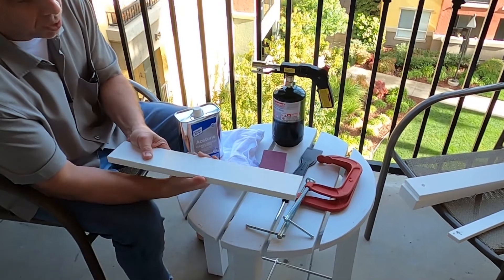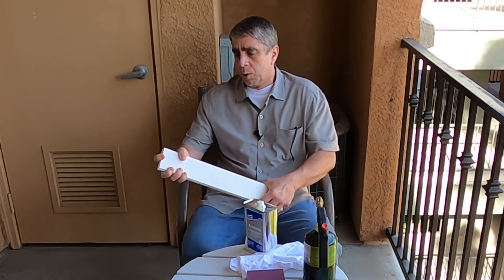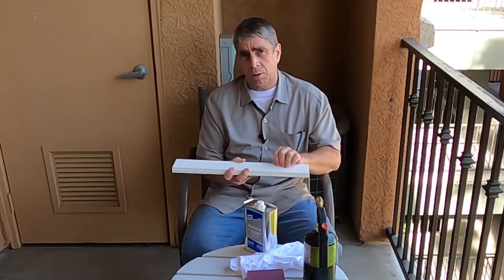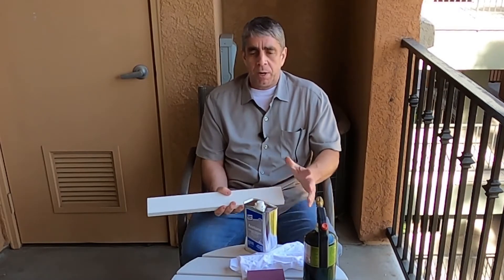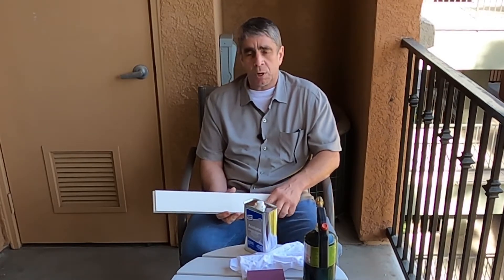Essentially, I'm going to attach a shelf to it. One thing to remember about gluing HDPE, or high density polyethylene, or any plastic using an adhesive, is that you just have to expect it to fail. I've never done it before, and I want to give it a shot. This is a good application because I'm still going to use mechanical fasteners to hold it together. In a year or later on down the road, I can look at it and see how well the glue performed. I'm going to follow King's manufacturer recommendations — they have a video on YouTube that I'll be following today.